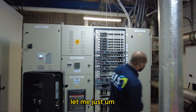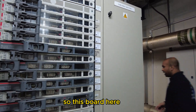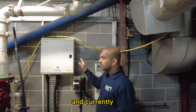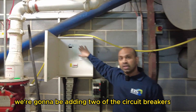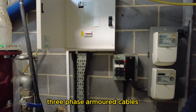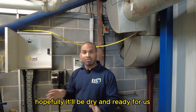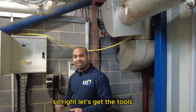This is the main switch panel that controls power to all of the sub distribution boards in this warehouse unit. This board — which has the DB-EV reference — gets power from the main switchboard, and currently has 100 amps of three-phase power allocated. What we're going to be doing today is adding two triple-pole circuit breakers onto this board, then terminating the two three-phase armoured cables. Once the concrete foundation work is dry, first thing tomorrow morning we can start fitting the floor stands and do all the termination work out there.